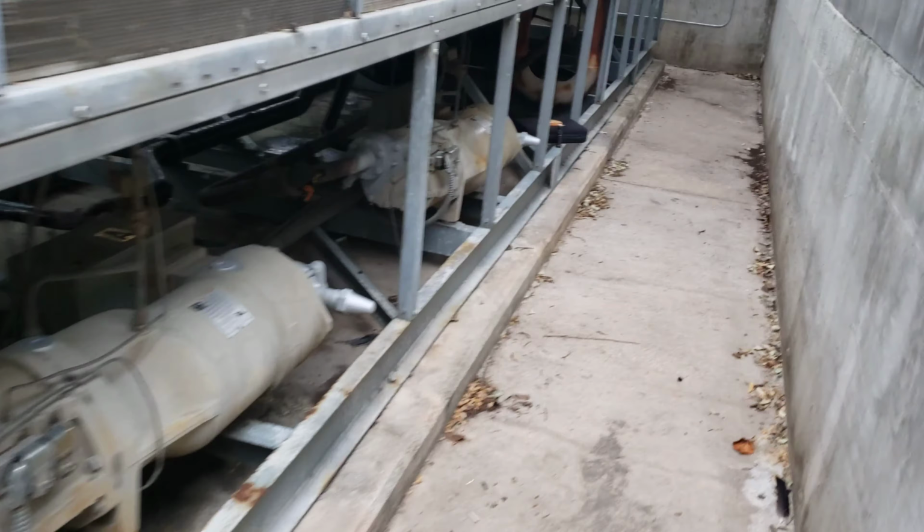and when I got here, we had compressor B on the other side online, and it was running fine without any issue. And then we locked that out to bring C on, the one that's been tripping the codes, and it ran for probably 10-15 minutes, and then it cycles off on temperature. I never saw it unload on the amperage. It was at full load amps the entire time, on top of starting at almost full load amps on startup.